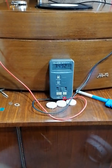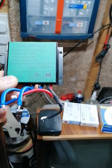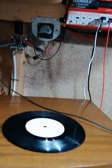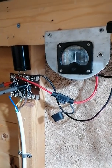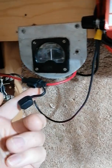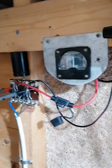It's now at 3.4. But this is really the only real way of getting a genuine idea of the output — a DC output. The charge controller needs to be connected up: you have to connect it to the 12-volt battery first and then connect up the three blue wires to the three phases off the alternator. This is probably a fairer test and kinder to the manufacturer, because it's charging this capacitor up, the capacitor will stay up, and there's no load on it except for the meter. The fuse is out so there's no load on it at the moment. I was going to try it this way to see if it would work without the charge controller, but it doesn't work, so it's not causing any harm.